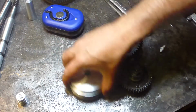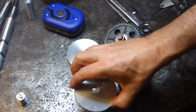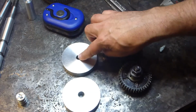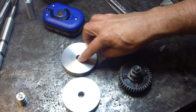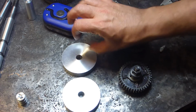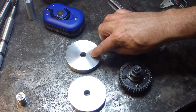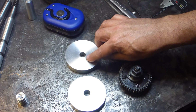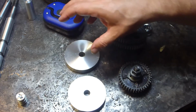So I'm going to continue on. I'll make these guys, and I do think that it's a bad idea to have aluminum riding on steel, so I will get some bushings. I have brass, but the powdered bronze really is what you want, and I think I'm going to re-engineer the pins. Big Bill from Big Bill's Iron Garage sent me the drawings for the pins and everything, and it confirmed what I had thought earlier. Those pins are supposed to be 1/2 inch, so my pins are worn. So I'll get 1/2 inch ID bushings, probably 5/8 OD, rebore this hole, press those in, remake those pins, and then at least the forward reverse will be good and tight.